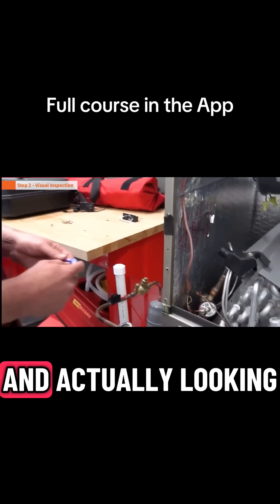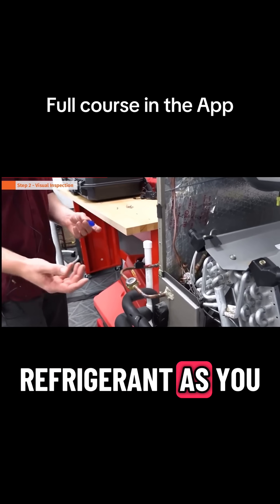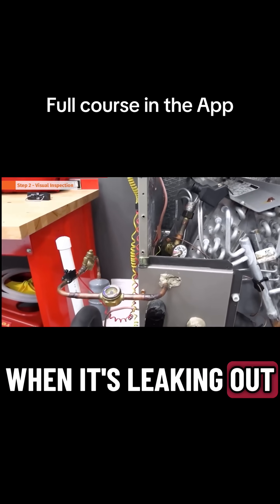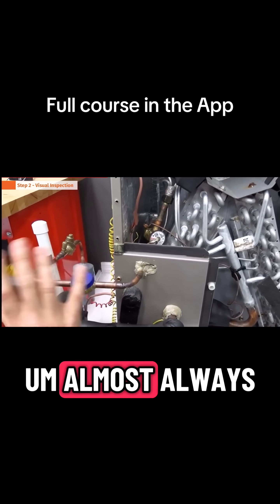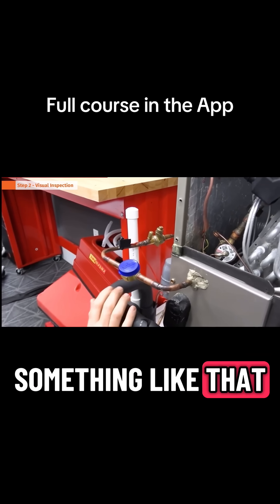How am I doing a visual inspection and actually looking for a leak on a joint spot? Refrigerant, as you know, is invisible — you can't actually see it when it's leaking out. Well, you're looking for the trace it gives. When refrigerant leaks, it almost always leaves a trail, unless that trail has been washed away by rainwater or something like that.